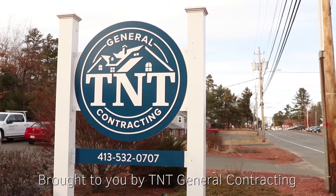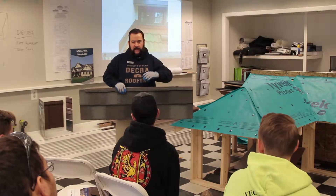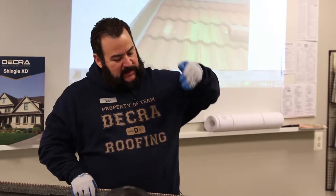With the 2XD products, the one thing you do not want to do is create a consistent pattern. Whether that's full panel, half panel, or full three quarter, half, quarter and stair-stepping it like shingles, you want to make the offsets as random as possible. The more staggered that your seams are as you're moving up the roof, the better overall it's going to look. If you start lining up seams like this on the roof, you're going to see it when you get back down — it's going to be awful.